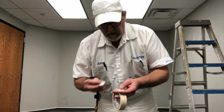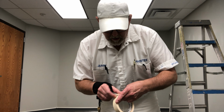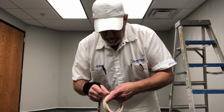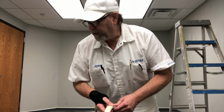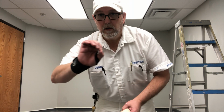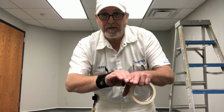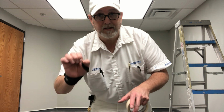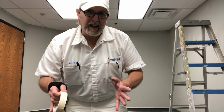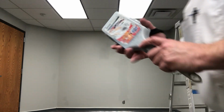And just in case I forget to put it in the description below about what I was talking about. Now, if this was a whole different color, I don't want to mess with trying to get close above the cove base. So I'm gonna tape it off nice and sharp. It's only gonna be on the cove base. It's not gonna be up on the wall just a little bit. So I have to take a little bit more time in that case.